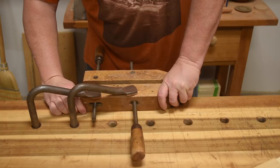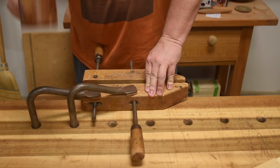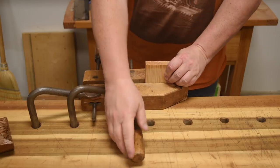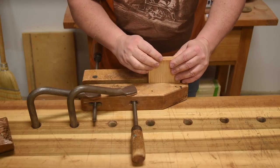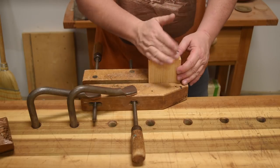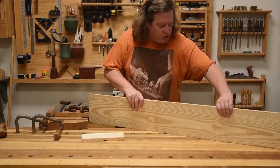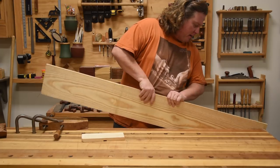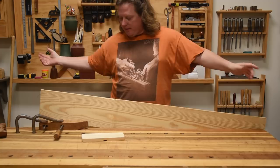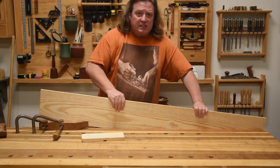I like to use two hold fasts because it seems to lock it better. I put the front face in line with the front of my workbench, and all of a sudden I have a clamp I can use for very large dovetails. If I'm dovetailing a case, I can put one of these on one side and one on the other and cut all my dovetails — really easy. If I'm doing something very long, it's super easy to clamp the front in my leg vise and let it rest there, or clamp it down. This lets me plane long stock and keep everything really stable.